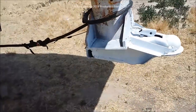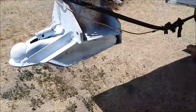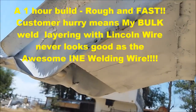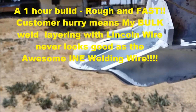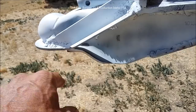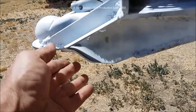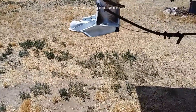It has a full 16,000 breakaway. So let's go over here. So a 16,000 breakaway on it. So I think we are quite strong. It's a solid build with a lot of heavy welds on it. And this here ended up being 1 7/8 inches, almost 2 inches above the truck bed, because the ball has a 1.5-inch collar on it and 2 5/16 ball, and it rode perfect. I mean, at all angles, even going down through ditches and stuff, it came out perfect.